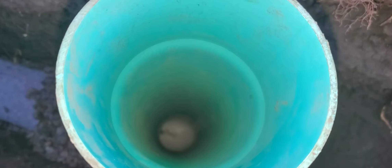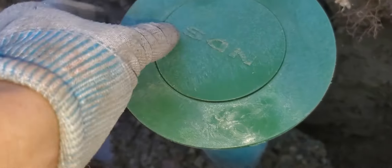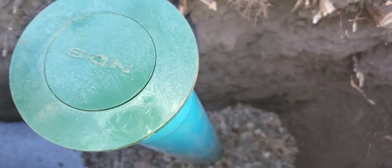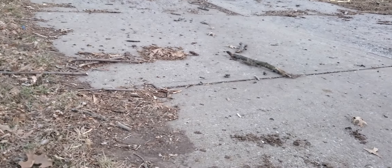And you can see I have a pop-up emitter. So what's going to happen is in an extremely heavy storm, it's going to fill up this end pipe. And when it gets to the end, the water will just push this up. I'm going to grade the ground around it to be a little higher and have it sloped slightly down here so it'll just run down my driveway.